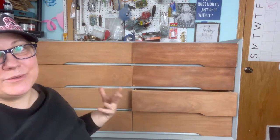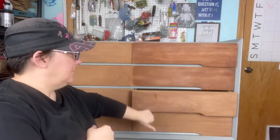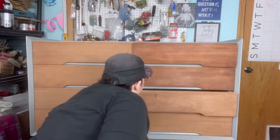Maybe that's a good thing that happened, because then you can see what you need to do — you can see what it looks like when there's an error. So I've sanded that again and re-sanded this whole drawer and the next drawer just to be on the safe side. There is no color in tung oil, so this is just the color of the wood. This is what if you wet this wood, this is the color that it would be. There is literally no color in tung oil — I didn't know if there are going to be people like, 'I don't want to darken my wood.' This is the color of the wood.